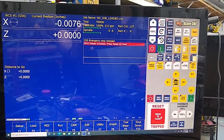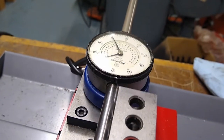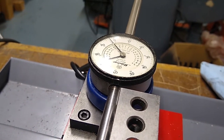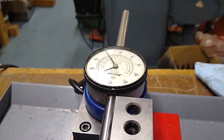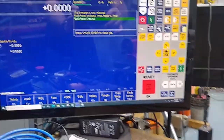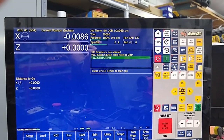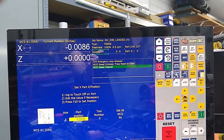Okay, we're back. We want to back off so I'm going to go in the positive direction a few thou to take the lash out of the screw. We're back to zero. I'll adjust my dial a little bit — I know you guys won't be able to see the needle quite well, it's hard with a camera. Alright, the backlash is out. Now we want to go into F1 Setup, Part, Set X, F8, and zero X, F10.